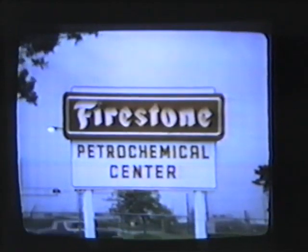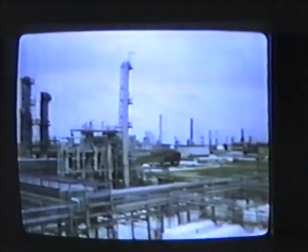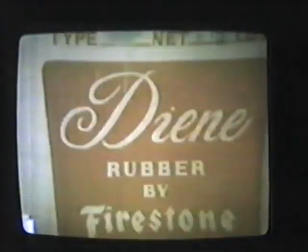But most of the rubber used in today's tires comes from petrochemical complexes like this one. Here, synthetic rubbers called elastomers are chemically tailored to meet the demanding needs of modern radial tire components. Some tire compounds contain blends of both natural and synthetic rubbers.